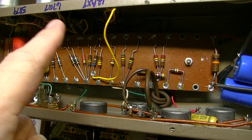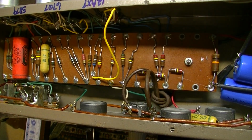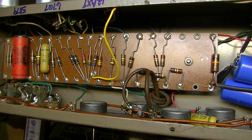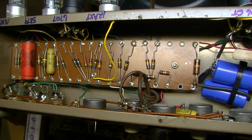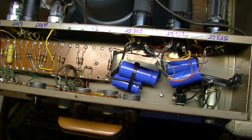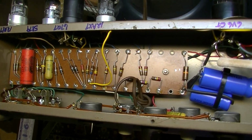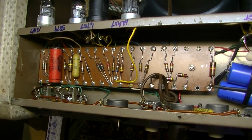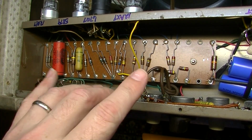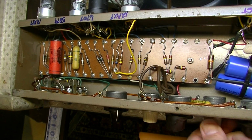Yes, that's right. They are underneath this board. On these old 50s Gibsons, this is one of the downfalls of these. And I have no understanding whatsoever why a company would do this to any lowly repair person. But they have stuck most of the capacitors underneath that board right there. So in order to service this properly, we are going to have to yank this board out and replace the capacitors, probably in the tremolo section.